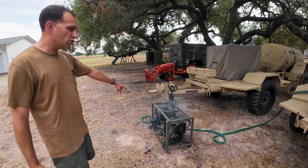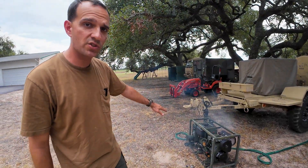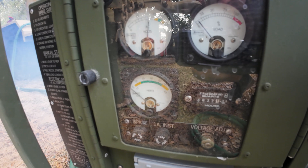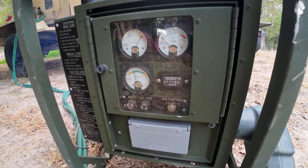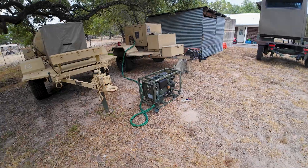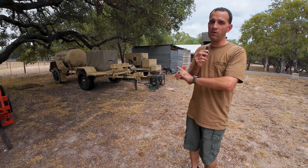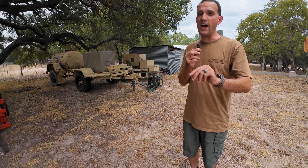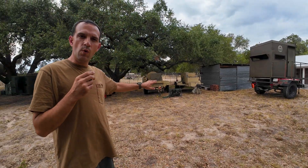How you can tell it's getting better is if you look at your gauges. It's running at proper RPM if the gauges say 62 to 63 Hertz on the Hertz gauge. You can probably hear it now — it's still stuttering just a little bit, but it should be at where it is right now. Then you want to put some load on it — at least like a 70 to 80% load — to purge the final amount of air out of the system, because until you run it on load, that won't purge all the air out. And it's pretty well cleared itself out now.